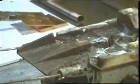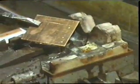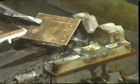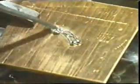In order to produce this alloy and form an effective bond, the copper surface must be free of grease or any oxide layer. Here we're heating just an ordinary piece of copper sheet. As you see, the alloy isn't forming, the solder's running off. That's because there's a natural layer of oxide on the surface.